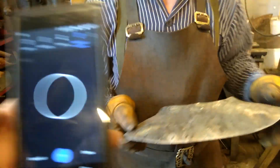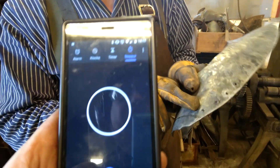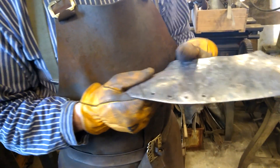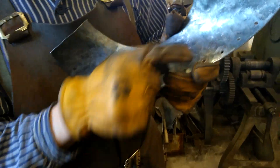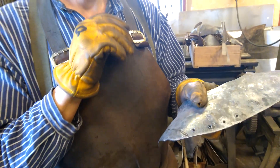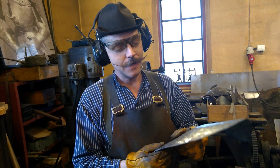This was much slower. And you still have the burrs here, so you have to take the burrs away. To create an illusion of it being a punched hole, you can take it away with a drill, or you grind it off, or you take a file to file it off.